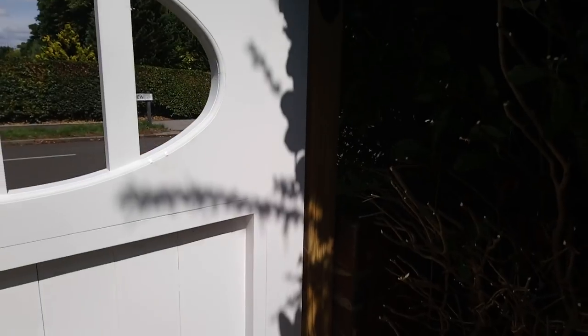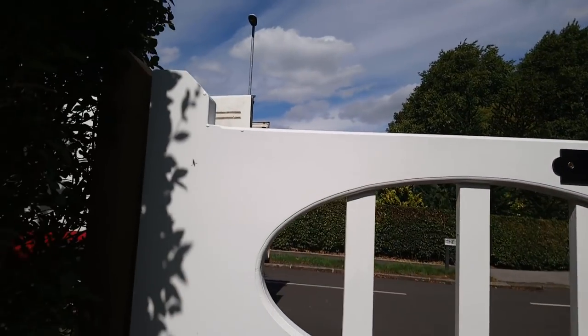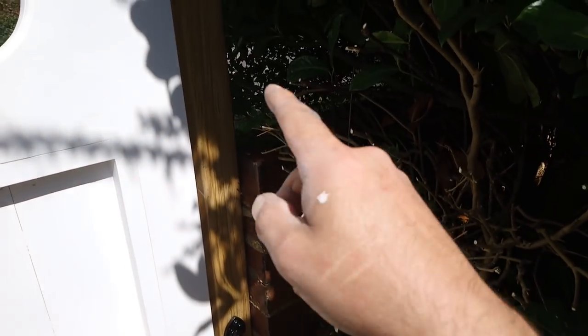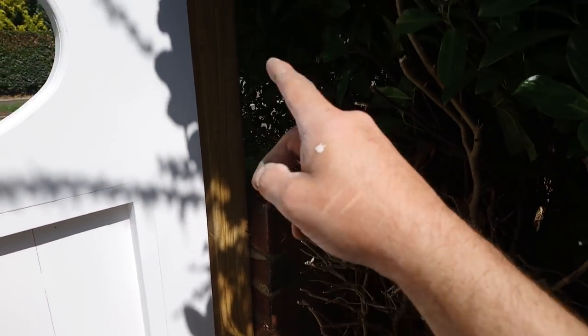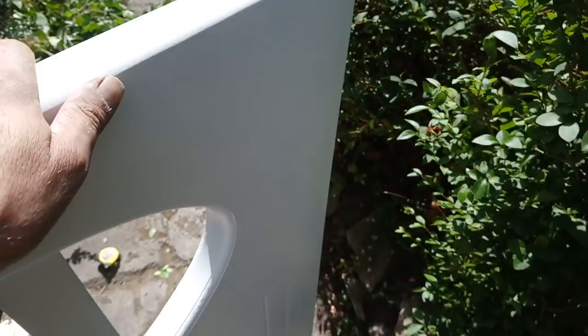That post is holding alright at the moment, but in time it'll start sagging a little bit. The wood will relax, then it'll start banging up there. So I'm just going to put that tie back. I could maybe put a bracket back to the wall, but I want it at the top really, and it'll be hidden by all this. I'll put the rest of the screws in